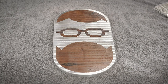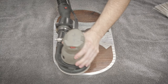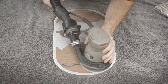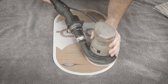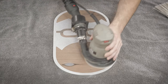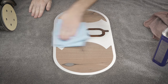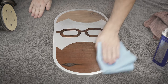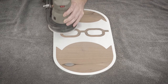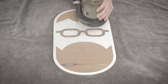Now it's time to finally finish the face. I followed pretty much the same process as the sides: starting with 80 grit on the random orbit to get rid of machining marks, then moving up to 120, 180, and 220. I did end up stopping at 220 for reasons I'll get to in a second. I was really worried about embedding aluminum dust inside the grain but it actually went really quickly — maybe a minute or two per grit — and in between every grit or every other grit I just wiped it down with a little bit of mineral spirits, let that dry, and then proceeded.